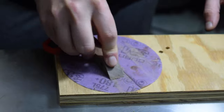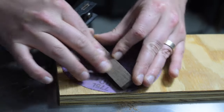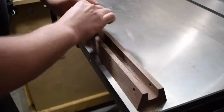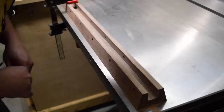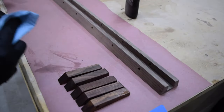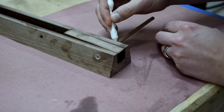I used some spray adhesive to attach a sanding disc to a plywood board. Then I sanded the hangers, breaking the edges on the back side only. I then clamped the frame down and sanded away the cut marks left in the dado from the table saw. I used Walrus Oil's Furniture Finish to finish this piece. Since getting to the hangers and dado later would be difficult, I applied finish to them prior to gluing in the dowels. I let the finish dry for about 12 hours then glued in the dowels, only applying glue to the outside hole then the dowel just before pushing it in.